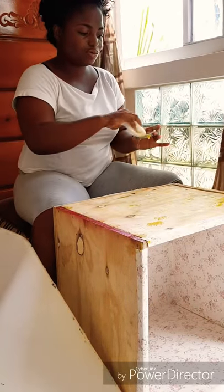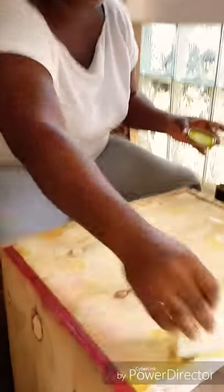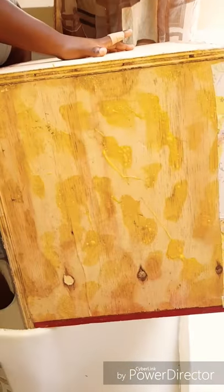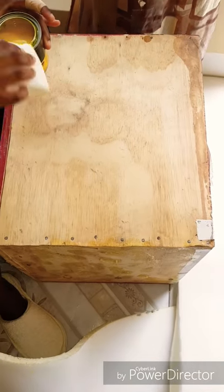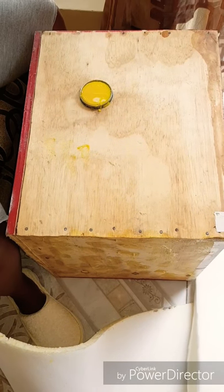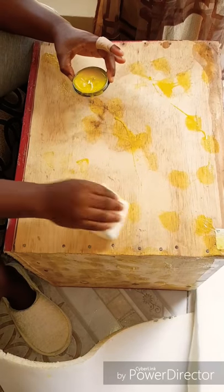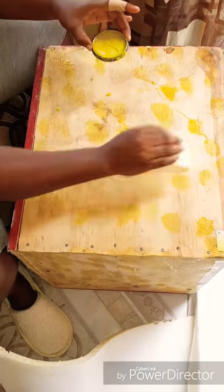So this is what I'm doing for that there. This is how I'm tapping it along. Come closer and see. That's how I'm tapping it. Okay, so I'm going to go ahead and do another side while that side cures a little bit. I don't want to dip too much into the glue. That's why I poured a little into the cover of the Patex C5500. So this is how I'm doing it, fast, in that tapping motion, because you don't want any of your C5500 to dry.